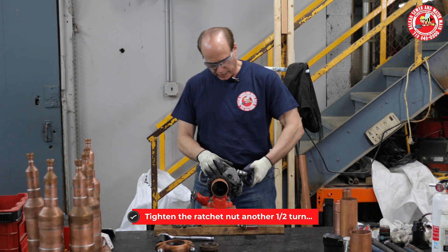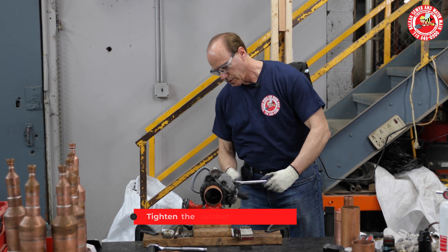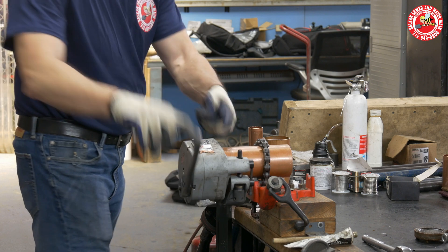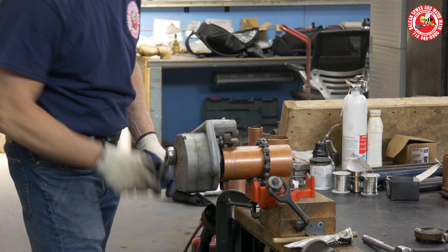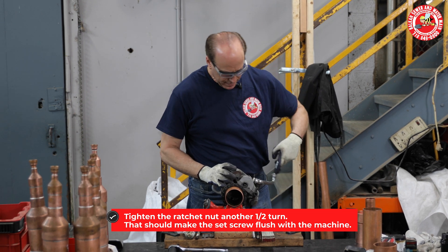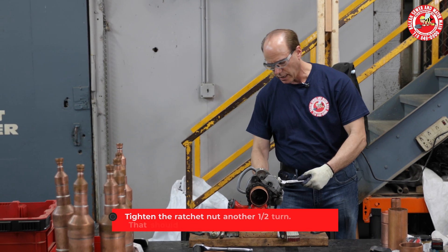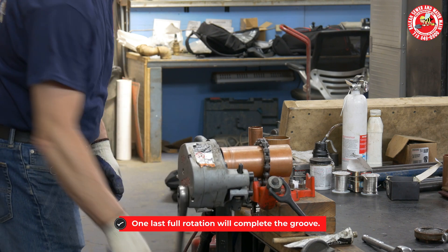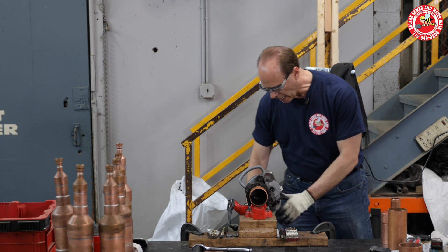It loosened up. Now I will reattach it back in here. I will go another full half turn, then go back to the back and do one more full rotation. I can tell that my groove fitting is nice, even, and uniform. I can tell I completed the rotation because it just loosened up on me. Now I'm going to touch this screw — I still have more slack, so I know I have not fully grooved the copper. I'm going to go another half a turn. That's tight now, so I know when I do this one last rotation, I'm done. One more full rotation — now I have a nice groove fitting.